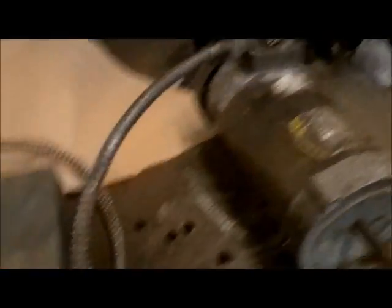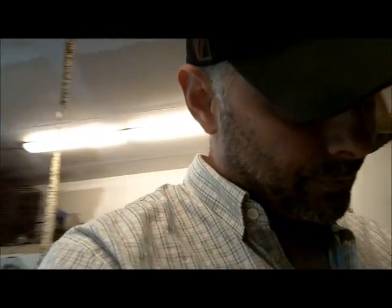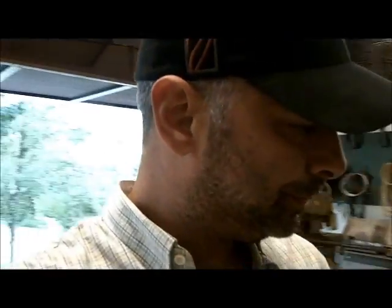Full bore. Anyway, turn it down, power it off. This is going to make a great little belt sander — I'm going to make a 1-inch belt sander out of this, because a half horse is not really enough to do a 2x72 belt sander, but I do plan on building one eventually. This DC motor, if you just reverse it, you've got a generator head — ideal for a small wind turbine.